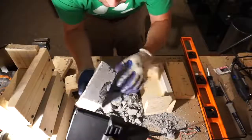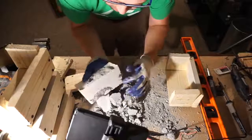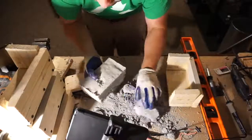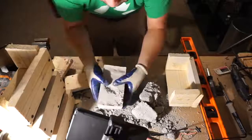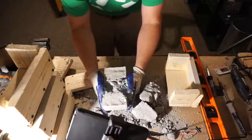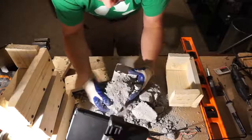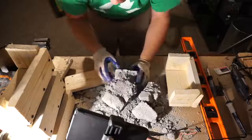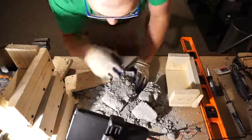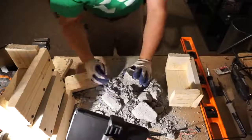This was the first brick that I poured. It was the lightest of them all, and it was also all the Aircrete that was on top of the bucket. It was kind of fluffy, and it really didn't feel like concrete at all, which might be because it wasn't mixed right. It didn't hold up with the consistency. I tried to put some steel wool at the bottom, just trying to experiment where the steel wool might add some reinforcement, but it just fell apart in my hands. So the light and fluffy Aircrete wasn't the right consistency.